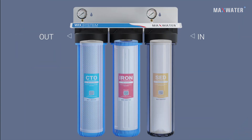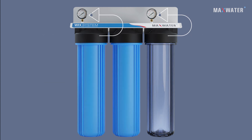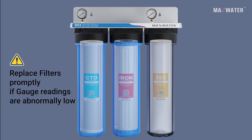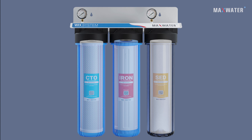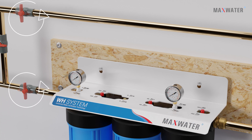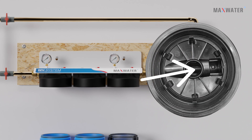Keynotes: Due to the system's nature, expect a slight pressure drop from the iron-manganese filter. Monitor your water pressure closely with the pressure gauge to see if there are any drastic changes. Replace filters promptly if gauge readings are abnormally low, indicating clogging or exhaustion of filter media impeding water flow. If a leak occurs at the pressure release button, turn off the water supply, purge excess air by pressing the button, and remove the housing. Tighten the screw located beneath the red pressure release button as needed.